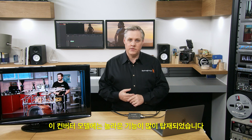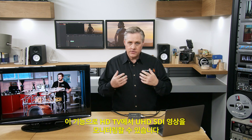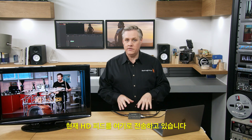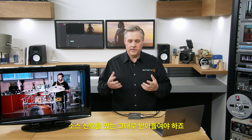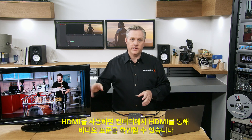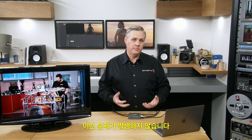There's a bunch of features in the converter I'd like to talk about. It's got a built-in Ultra HD to HD down converter, which means you can monitor Ultra HD SDI on an HD television. Unlike HDMI, with SDI the data just comes down the cable and you've got to take the source as it comes in. So if it's Ultra HD, you won't see anything on a regular HD television — the built-in down converter solves that problem by detecting the video input and fixing it automatically.